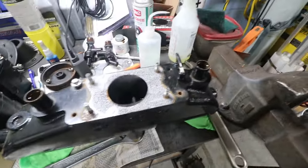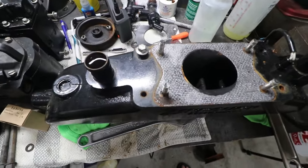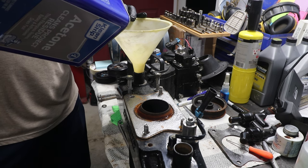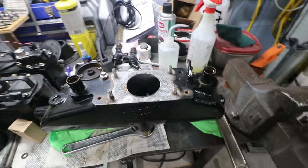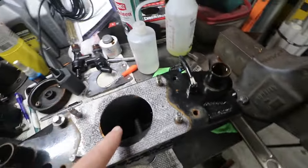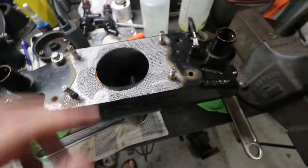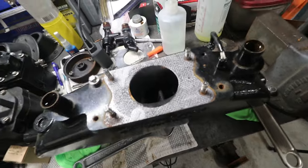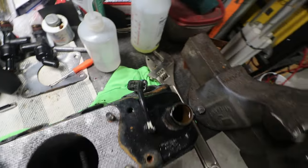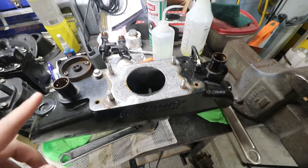Since that bottom port is blocked off, what I did is put a funnel in here and filled the coolant passage with acetone. There are a couple of different ways you can pressure test manifolds — one is to make block-off plates that cover all the ports, fill the exhaust ports with water, then inject air into the cooling passages and look for bubbles. That's pretty involved, especially making block-off plates, and I didn't really want to go down that route. Using acetone instead works because its viscosity and surface tension are way lower than water, so even minuscule cracks will show as a leak.